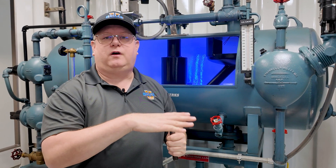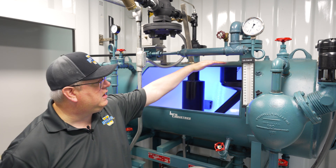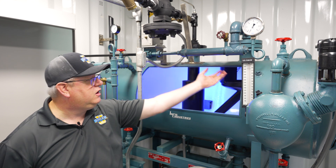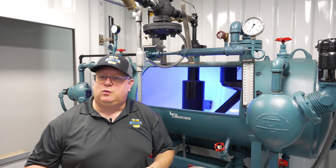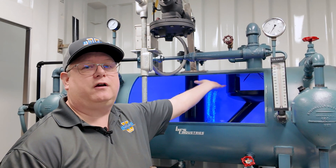The design conditions sometimes aren't the real world conditions, so it's not unusual to be making up more water than previously expected, leading to temperature issues on the deaerator. That occurs because if air isn't evacuated from the top of the deaerator, we're spraying into air, not steam. We can't heat water the same way with hot air as we can with steam — that's why we use steam. The key is to eliminate what we call air blanketing if it occurs.